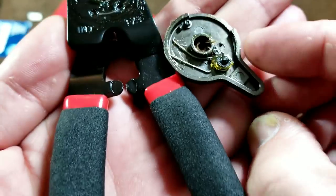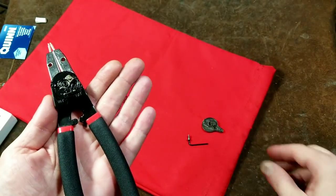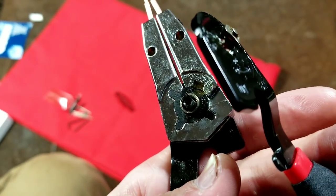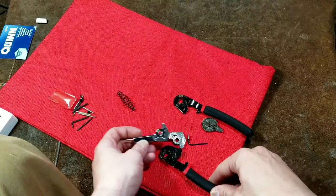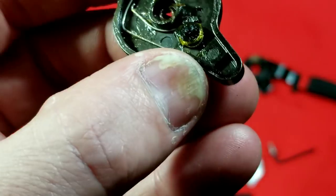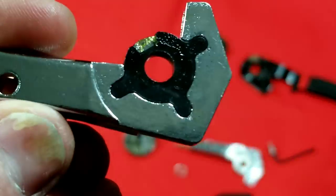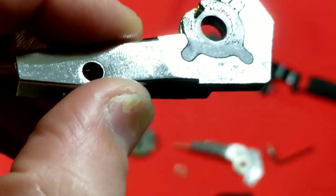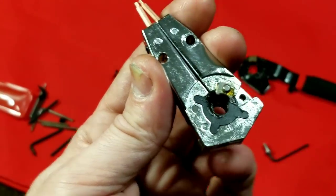This is what we have inside — very interesting. There's a very odd type of little clock spring in there which engages this little metal piece — that is the locking cam or the actual locking dog. Interesting — there goes the parts. We have a ball detent and in the arms we can see there are steel inserts — and they are steel — to help reinforce right where the locking dog sits. I think that's a good idea.